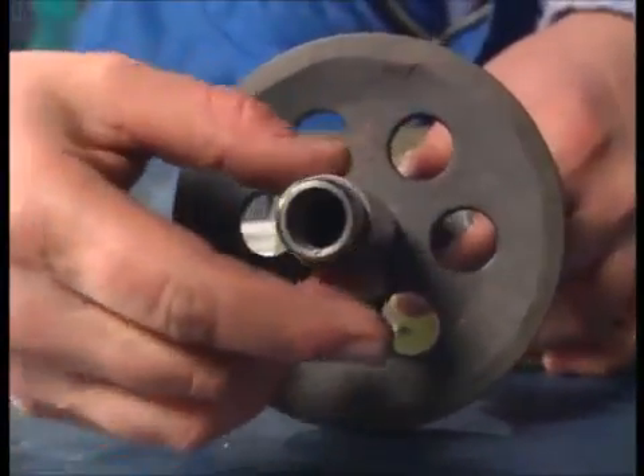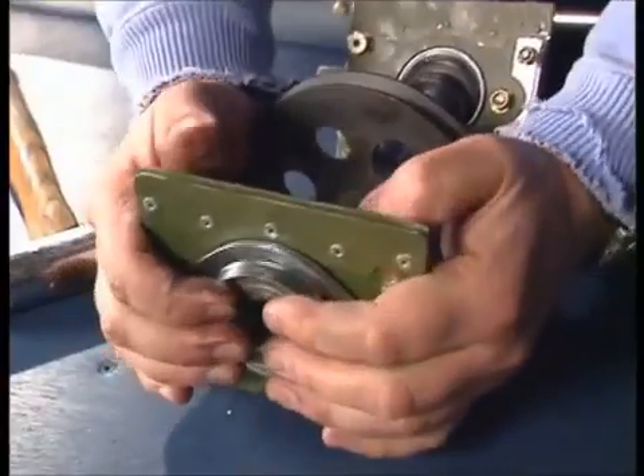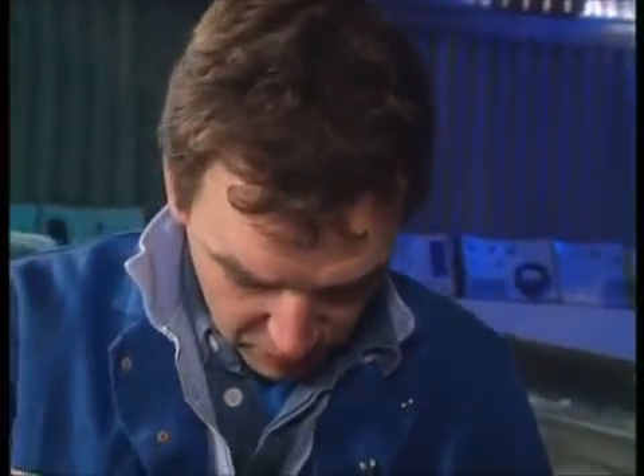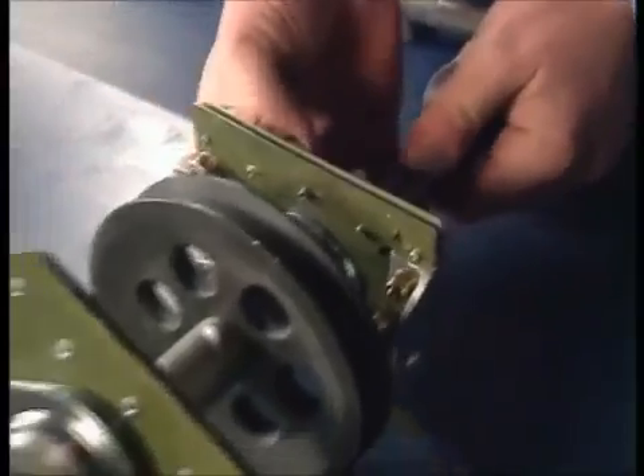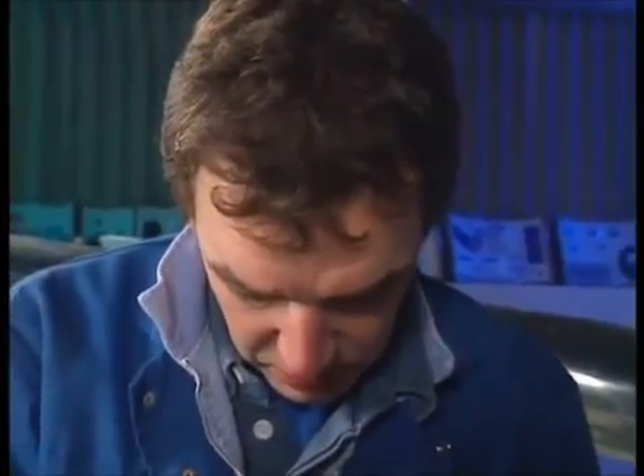One aluminium pulley on — what a neat trick. I have to say I'm really surprised that worked, but it's on. Next goes on this sleeve, then the bearing lock, and then finally the other bearing plate. All the other bits on the blade side can all slide up towards the boss of the pulley like so, and then the whole lot can go in the tail boom.